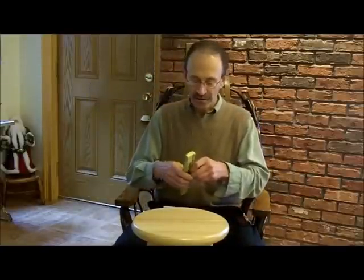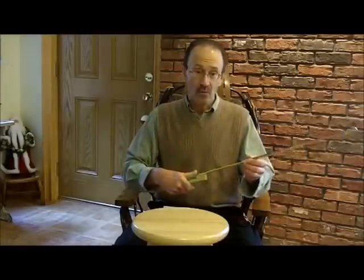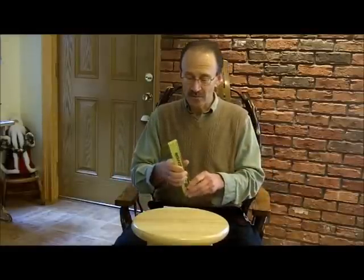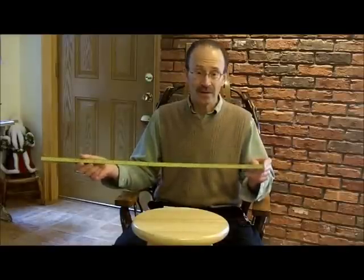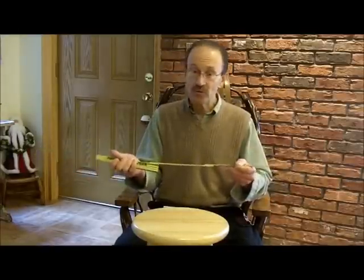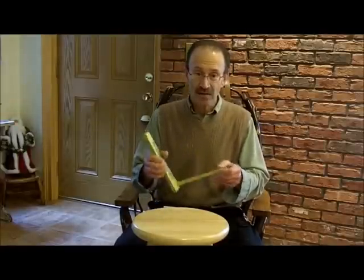Now I'll show you quickly a meter stick. Here in the United States we've been holding meters off at arm's length in favor of the foot and yard measurement. A meter is approximately 39 inches long in American measure, but it's broken up further into centimeters and millimeters — meaning hundredths and thousandths of a meter. I'm going to get down on the bench and show you the fractions of an inch. That's the challenge everybody faces when learning to take accurate measurements — it's not the inch increments, it's the fractions of the inch. Those little marks between the inch marks — what do they mean? We're going to find out in a minute.